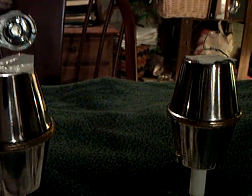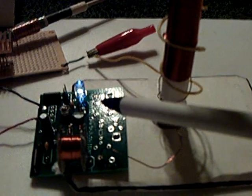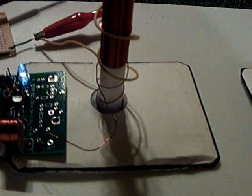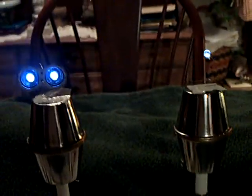Watch the lights. Okay, there go the lights right there — you notice they're both on. There's the tuning light on SEC 18-1. It's very handy because you can see how that particular oscillator is tuning with that tuning light right there. It's got a little tuning capacitor there that is extremely hard to tune. I need to make a tool because this little screwdriver doesn't work — every time you get it close, you throw the capacitance off with your hand. I am tuning this with the tunable inductor on the SEC 15.